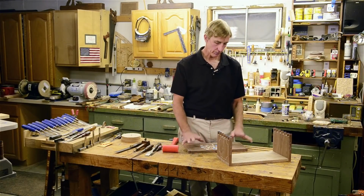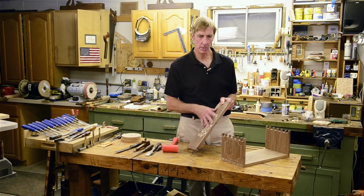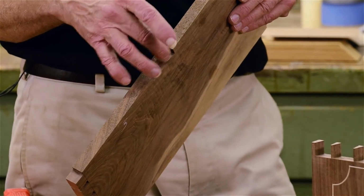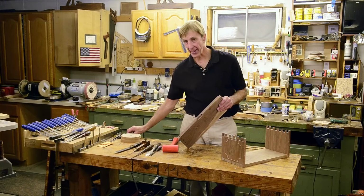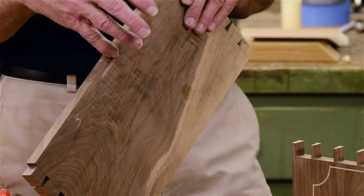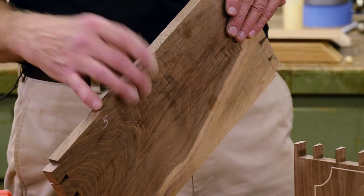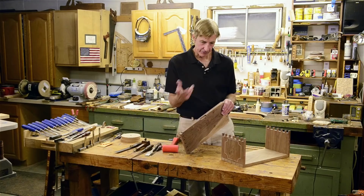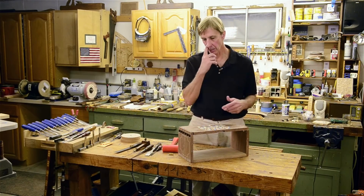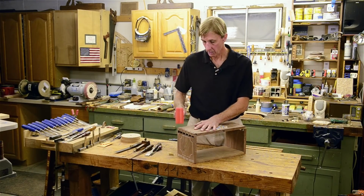Another little thing I wanted to show was, again, for making these in a sort of production run, I just made a little jig that made it much quicker to cut the inlay for the latch for the top. Normally I would just do this with hand tools, a gent saw and chisels, and it would go pretty quick. But I've found making a lot of them, I can do it even quicker by just spending the time, making a jig, and using a router.